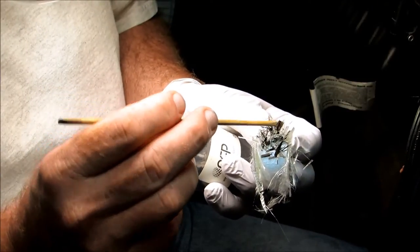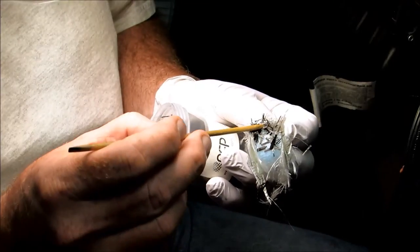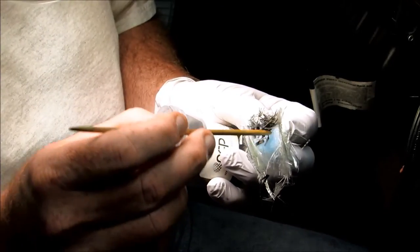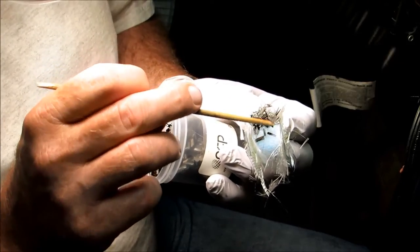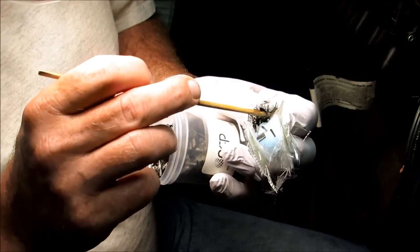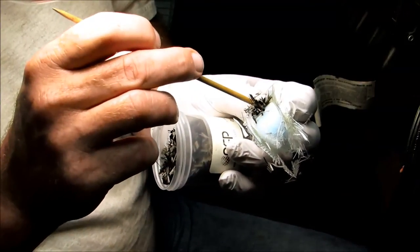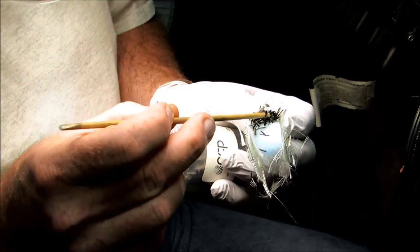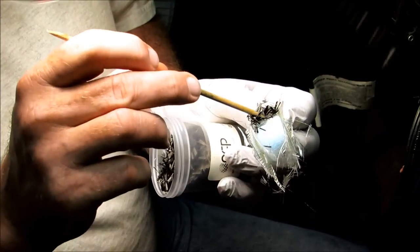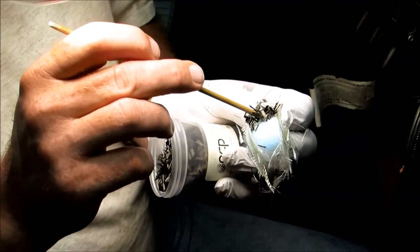This is the point that actually scrapes on the ground and grabs the wire when you land on the carrier. And so it's a reasonably sharp point. You want it to get under the wire. You don't want it to bounce over the wire. You don't want it to be so dull that it just smacks the wire and carries over the top.